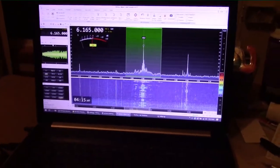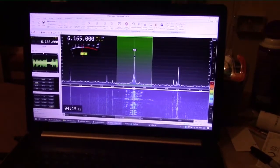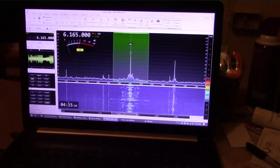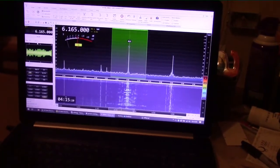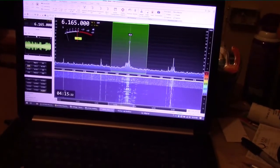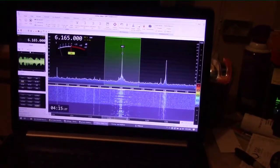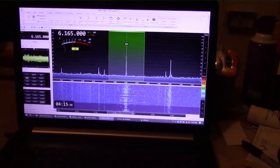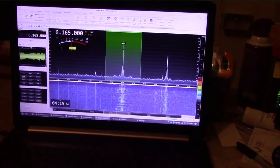Tomorrow we'll go ahead and get the antennas outside and we'll run it through another common mode choke indoors, and that'll help cut down some of the spurs and some of the inadvertent signals that we're picking up, and we may see an additional drop in the noise floor, which will be very, very nice. Plus getting this antenna away from all these noisemakers.